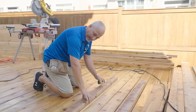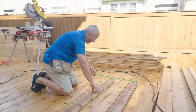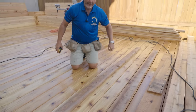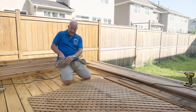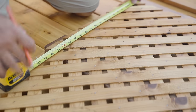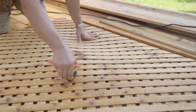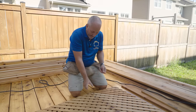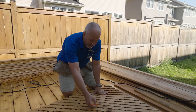Here's my system. I always have a couple of extra 2x4s laying around. What I want to do is make that square — we're going to call that the top of the lattice. I'm going to measure it down so that my 16 is in the middle of this board, and at the other end my 18 is going to be in the middle of the board. Now I'm looking very carefully at the staple placement — the middle of my board is right here at 16. At 17, around the halfway mark, at some point I'm going to be cutting through a staple, and that's where it gets tricky. Cutting through the staples is brutal. Since I'm using that bottom 2 inches of wood, I'm going to throw a chalk line on, but when I'm cutting, every time I get close to a staple I'm going to adjust up or down a half an inch and finish my cut away from the staples. It's hard on the blade, and that damage usually results in tears in the wood.